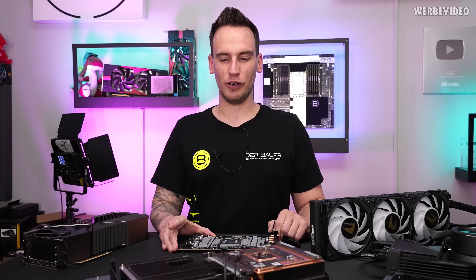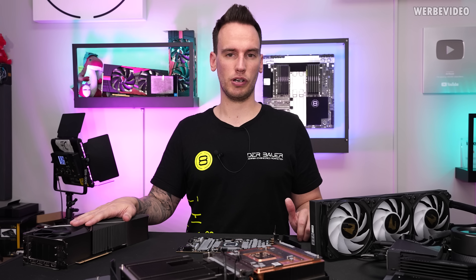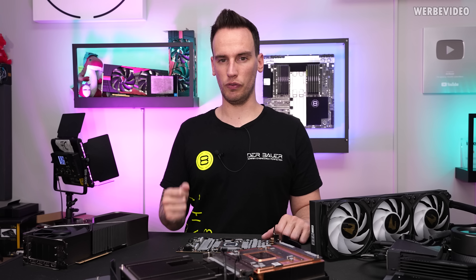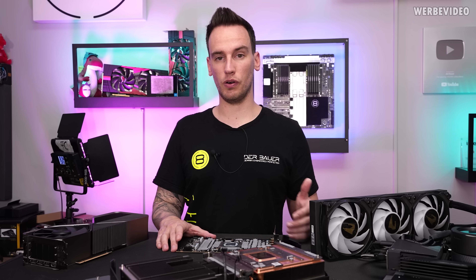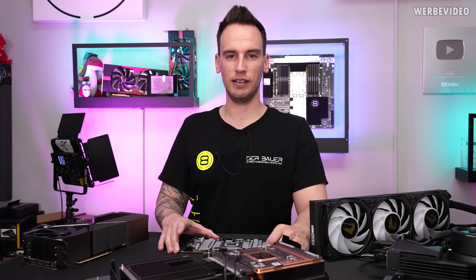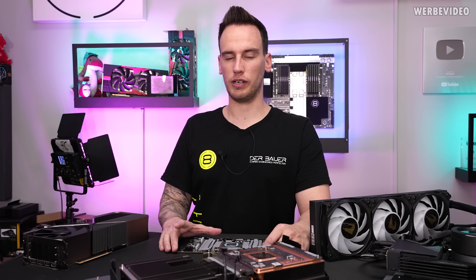And with this we reach the end of this quick video. I simply wanted to find out if the better cooling of the AORUS Master compared to the Founders Edition could generate higher clocks — but that seems not to be the case. We are still purely voltage-limited. We are definitely not power-limited, and even running the fans at 100% speed — which lowers thermals by another seven to eight degrees Celsius — you cannot clock higher. GPU-Z indicates we need more voltage, which is not easy to get because NVIDIA limits everything — not over BIOS, not over software. But I will definitely reach out to Elmore; maybe he can help us hook up an EVC to this card, get it working, and maybe get a bit more voltage and clock the card a little bit higher. If there's anything I can find out, I will definitely let you know. Thanks for tuning in — until next time, bye bye.